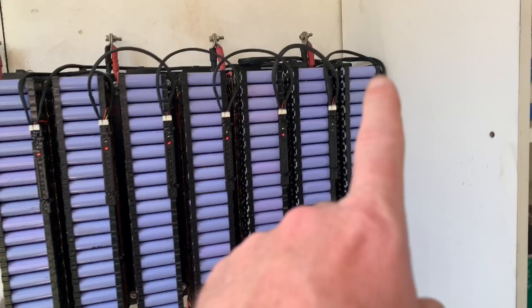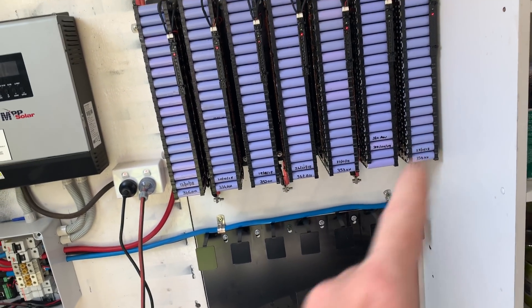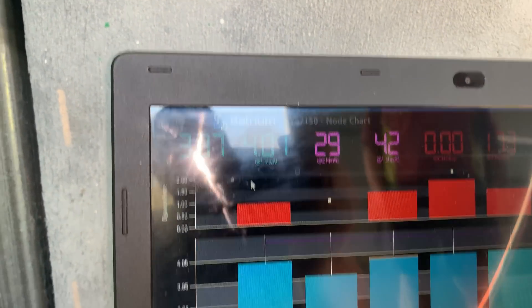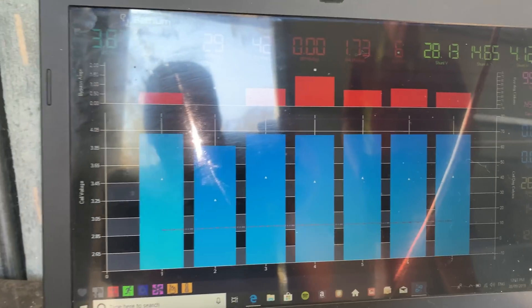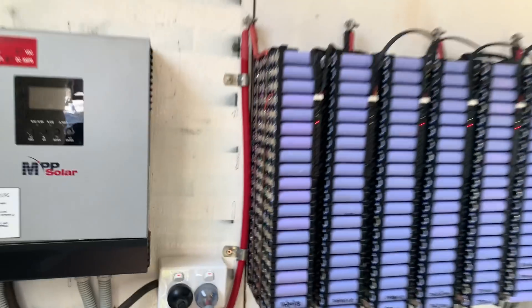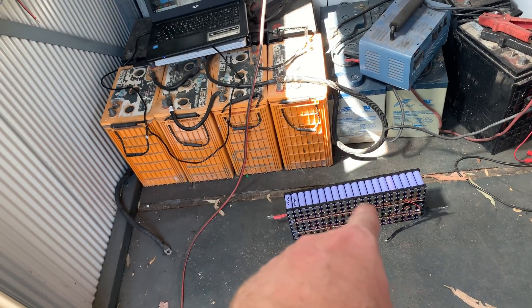It only took a few minutes to change out that cell and we're all back up and running again. Unfortunately I didn't put much thought into the actual voltage when I put it back into service, so it's a little bit low — 3.87 volts — while everything else is higher. The battery management system flagged it as a bit low and started bringing it up. That's in progress now, so we'll let the battery system sit there and do its thing. I'll get back to the workshop and we'll start some tests on this.